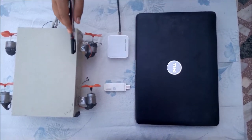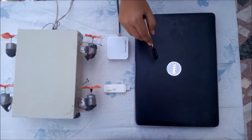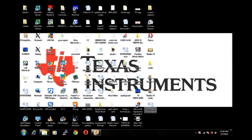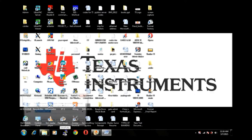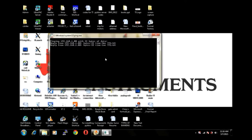The router is configured as a repeater that connects the dongle's network to the aquabot. The network of the dongle is connected to the PC. By this connection, there is an interconnection between the aquabot, TP-Link, dongle, and PC. The IP address of the BeagleBone Black's network is 192.168.1.80, and this is the reply received by pinging that network.